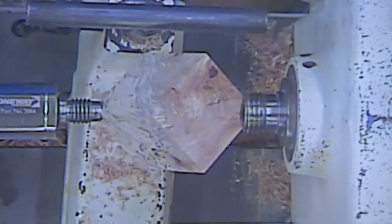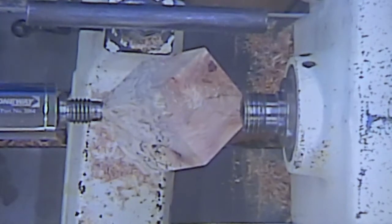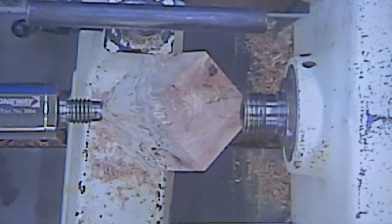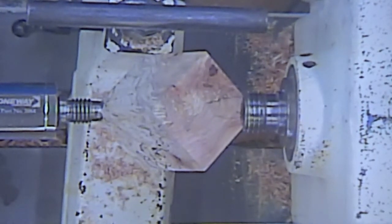My process, there's a couple ways you can go about it. What I do now is I'll rough cut a length of wood, let's say 20 inches, and rough cut it, let's say 2 5/8 if I wanted to do this size box. Then I would go over to my jointer and join 2 sides to get them absolutely 90 degrees. I set the fence up on my bandsaw and I slowly cut off the other 2 sides to 2.5 inches square. So now I've got a 2.5 inch square.